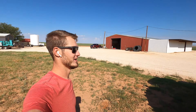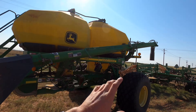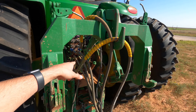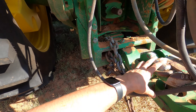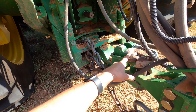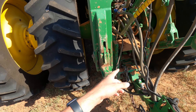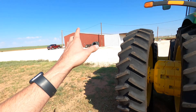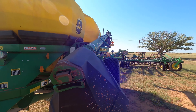Welcome back to another video. I'm about to go start digging peanuts, so I need this tractor. I gotta unhook it from this air seeder first — all my hydraulic hoses. Once I got all this done, I gotta go park it by the shop and take off the draw bar, because if I'm hooking it up to a peanut digger I can't have this on there. There's a disc right there in the middle that'll hit that. I'll unhook it here by the shop so once we're done using this tractor for the peanut digger, all the draw bar and parts will be here and it'll be easy to hook it back up to the air seeder once we're done digging peanuts.